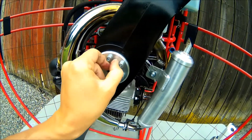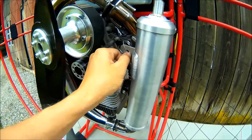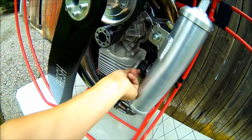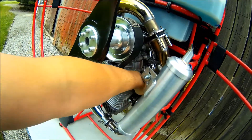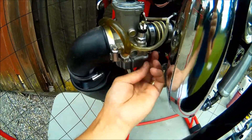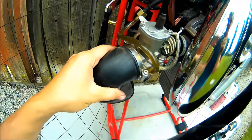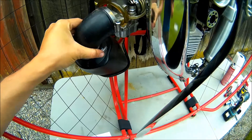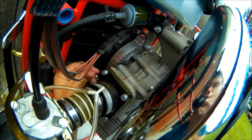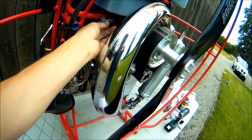I'm going to move to these prop bolts. Some people check this kind of thing every flight — I do not, I confess. I just tighten them, and if one rattles loose you should be able to feel it. Felt all those — this should be well attached there, that feels good. Checking all the ones in here, just everything you see, give it a little pull.